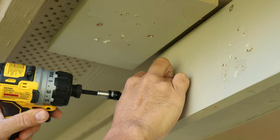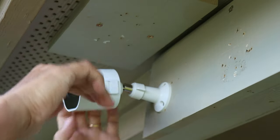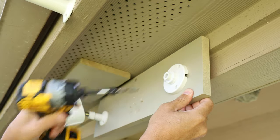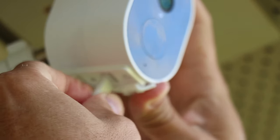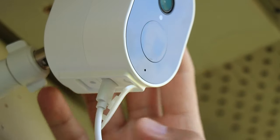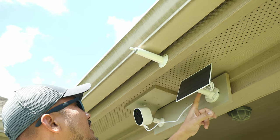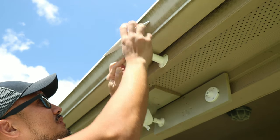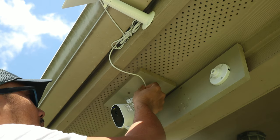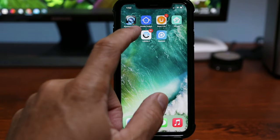To install: screw in the plastic mount for the camera with the three included screws, screw in the ball head, and screw the camera in. For the solar panel, screw in the plastic mount with the three included screws, screw in the ball head on the back of the solar panel, and screw it into the mount. Plug the micro USB cable from the solar panel into the port on the bottom of the camera, making sure the rubber seals the edges for weatherproofing. Personally, I would not place the solar panel under the eaves — I did it just for filming. I used a Reolink extended mount to properly position the solar panel to get the most sun throughout the day. After some wire management it is ready to go — not a really clean install, but it will do.